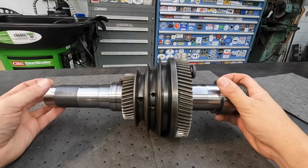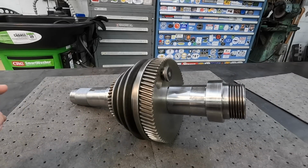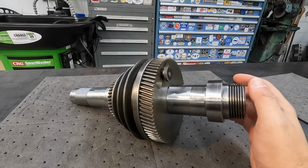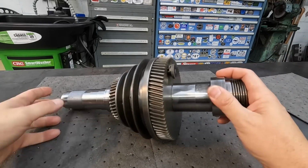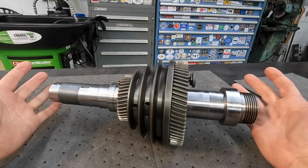So the problem that he said he had is that when he goes to put this thing in back gear, this has happened two separate times now, but recently this has happened, which caused him to go ahead and tear the headstock down to get it rebuilt or to find out what the problem was. And then once he did, he realized what was wrong. So he puts it in back gear and then the pulley, the shaft just locks up.